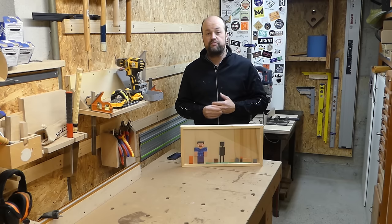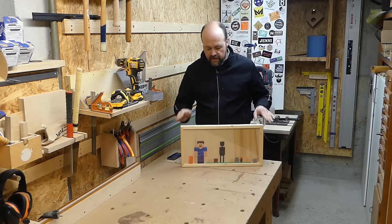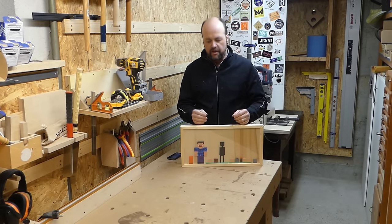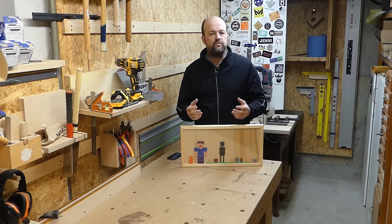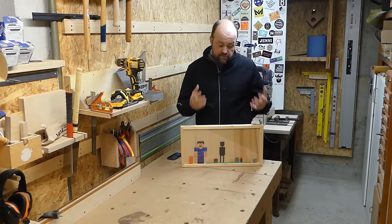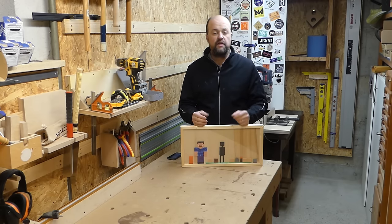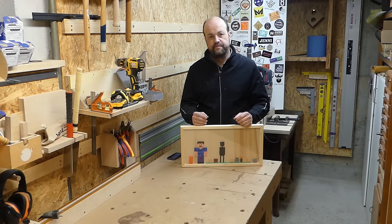This is something I have to practice because I haven't done it that often before. And I have to learn a lot more about using those planes and about looking at the wood and finding out which direction the grain runs in. Because while it worked on some of the pieces, smoothing them, it didn't work at all in others because probably I ran the plane in the wrong direction and then tore out some grain instead of smoothing the surface. So there is a lot more to learn before I can think of using a plane instead of a sander to get a smooth surface.